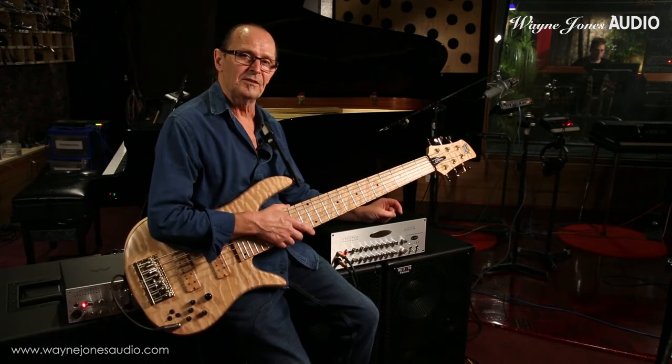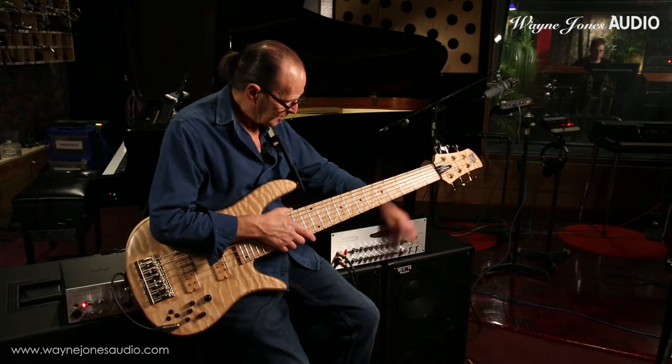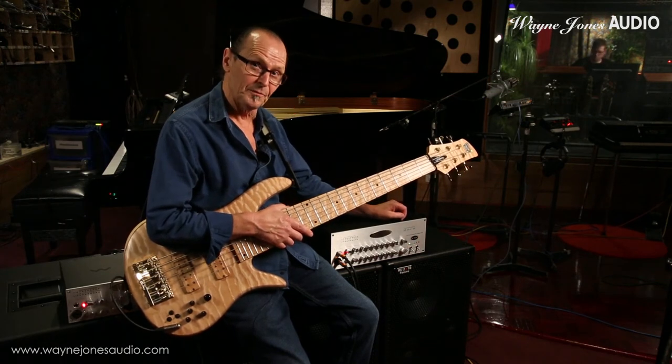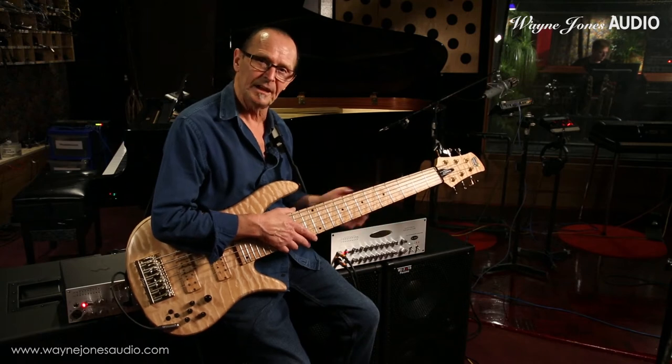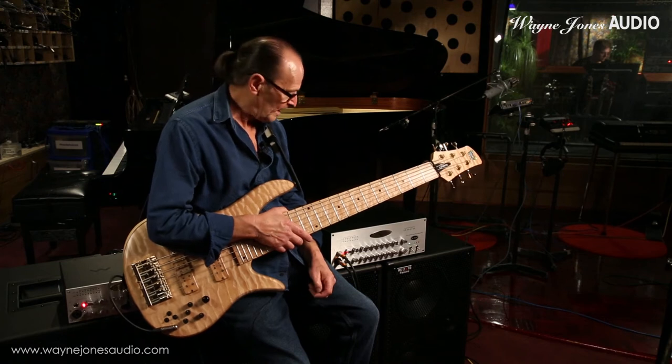Andre wanted extended top end from the very first preamp we did. So I changed the frequency on the treble that was on the first preamp, and I added an extra high frequency for him. So I added 10K.